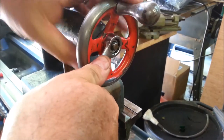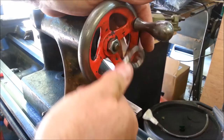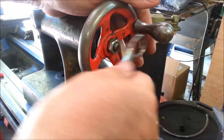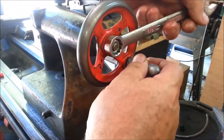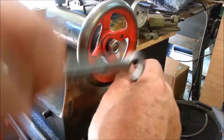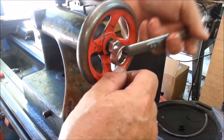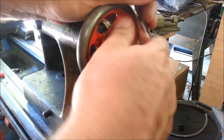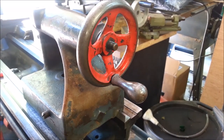That does not want to go together — I've got to solve this mechanical problem. The handle doesn't want to go all the way up on the woodruff key, so we're going to have to check this out more thoroughly. I can see I'm going to want to get a small broaching kit so I can clean up handles and things like this. I'm at the end of the thread — that's why I can't drive it on. You need to manufacture a washer.